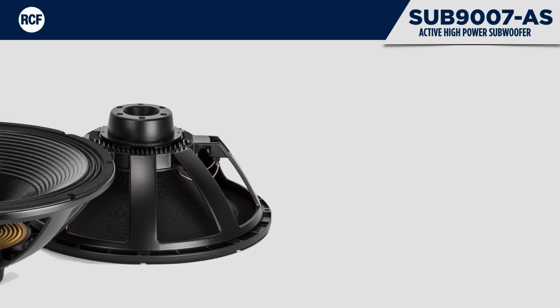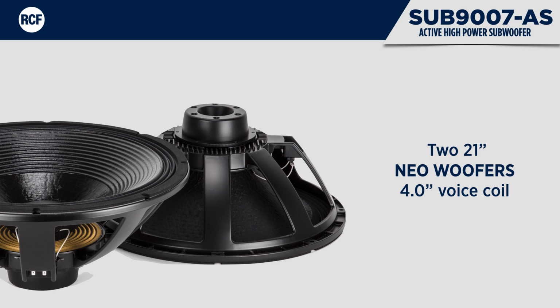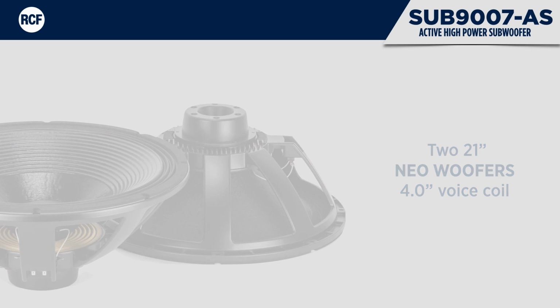The Sub 9007 AS subwoofer is loaded with two 21-inch neodymium woofers with a 4-inch voice coil handcrafted in our factory to produce incredible power handling, long excursion and perfect control. The dual forced air venting system provides very efficient voice coil ventilation and minimizes power compression.